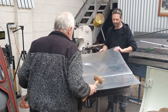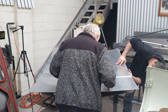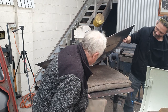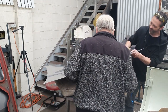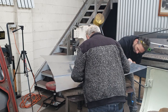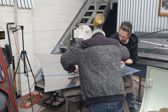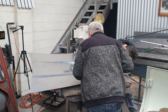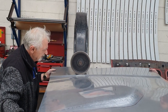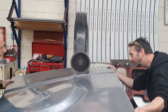We need to start putting some shape into this area now. Running the aluminium through the folder does a great job of putting a nice straight line on it, but it also flattens the bonnet and takes all the shape out of it. So we've got to start moving the metal with some shape — actually stretching the metal. Peter's adding an extra sandbag for support, then we'll run up and down that profile with the timber mallet to stretch the metal down. Peter's working this whole area from front to back. Then back to the wheel, Peter's starting to pull down towards the front of the bonnet, putting the shape back into it how it should be.